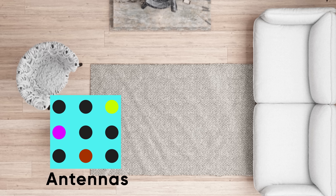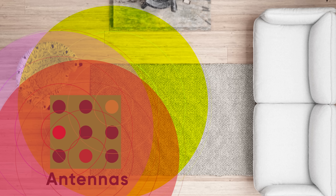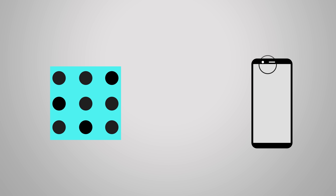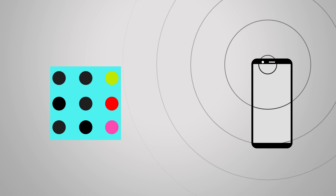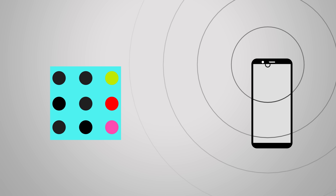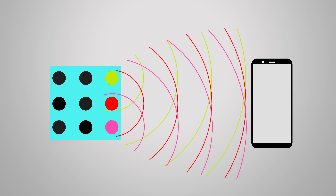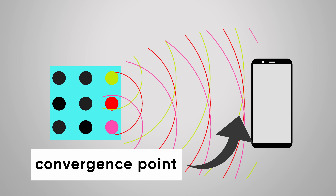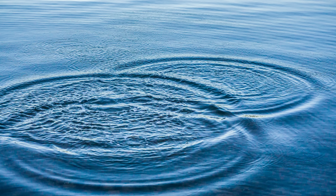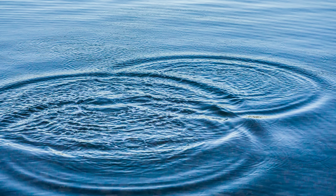Beamforming can be implemented in one of two ways. One is to stick a bunch of antennas inside an access point, and because each antenna is in a different physical spot, they'll all produce slightly different coverage patterns. The idea is to decide which antenna combinations hear a client device, like a phone, most strongly whenever it's transmitting to the router. So the router tries different combinations until it finds the best one, then times the transmissions from each antenna so they all converge at the same time at the spot where it thinks the client is. It's kind of like throwing two rocks into a pond and seeing the spot where the ripples come together to form one larger ripple.